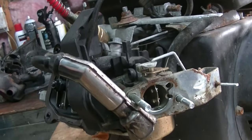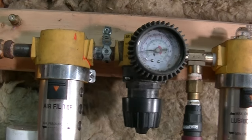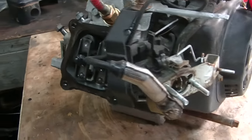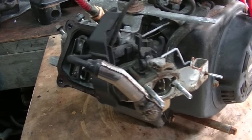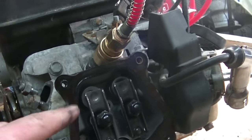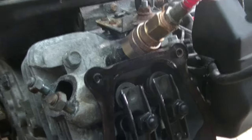That tells us that quite potentially the intake valve isn't sealing a hundred percent either. I've shut the air off at the compressor and you can see it slowly bleeding down — just get an eyeball on that gauge. What's happening is we're waiting for the air to bleed off before touching anything, before attempting to disconnect the airline or the crankshaft. Just let the remaining air bleed off until there's no pressure left in the system.